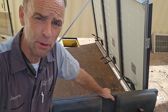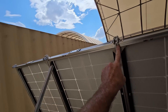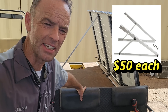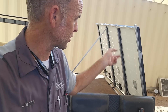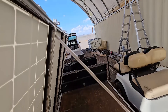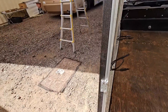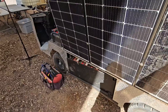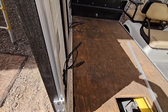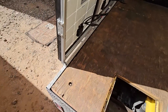I'm going to call it a day and get with the owner to see what they want to do moving forward. Thanks for watching — I hope this inspired somebody. Using 2020 extrusion to build a solar array I think is still cheaper in the long run. Those adjustable racks you can get online have short arms — usually only good for one panel, so you need two sets per panel, which gets quite expensive. Because I used the smaller stuff and the hinges are a little bit thin, even with four of them, I'd still be hesitant putting a lot of weight on them without back support. If we went with a bigger system, the bigger hinges might be fine.